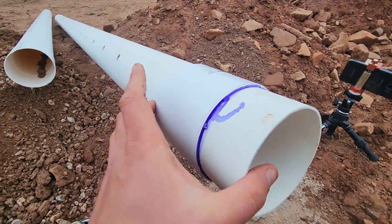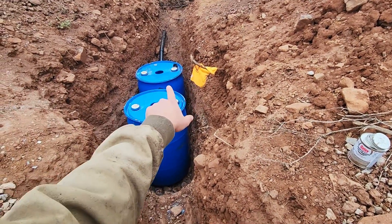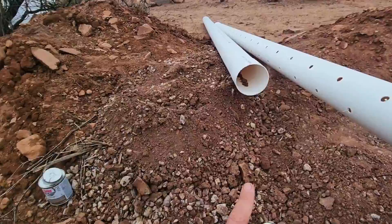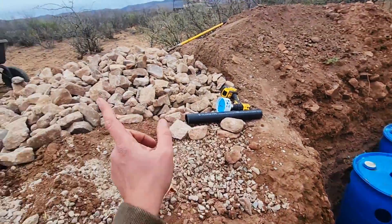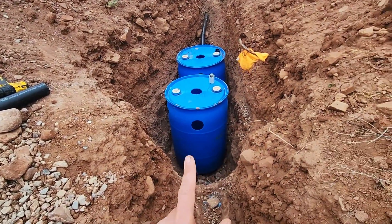We've got our connection here — I put a coupling on so we'll have something nice to rest up against on our hole. We've got our slope: it drops a little bit, drops a little bit more, and then our trench out here. Those two holes in the top will be for this pipe, and that will be our clean outs. We're moving right along — got our gravel over here, and hopefully getting this pretty close to done today, if not tomorrow.